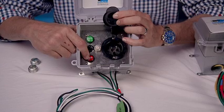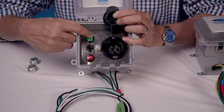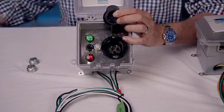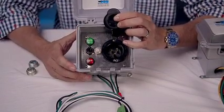The disaster comes to an end, utilities power is back on, the green light becomes illuminated. Both lights can be illuminated. This is a double pole, double throw, 3-position switch. Cut the generator, pull the plug, engage back to FPL power.